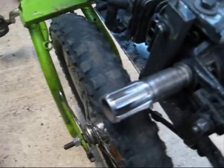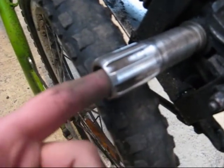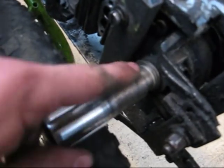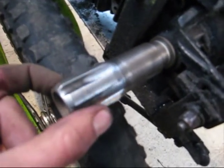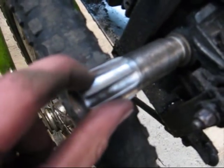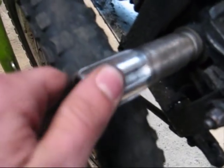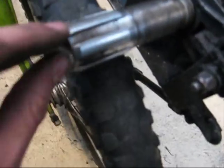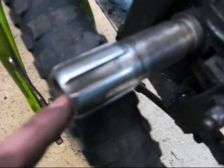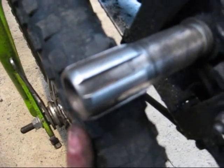Next thing is the spindle. This spindle is just a bit of — I think it's about one-inch pipe. I've bored it out with the lathe so I can get a spanner in there to tighten the nut that's right up here. And it had these grooves machined along it — I'm not quite sure what it was for, but it had them machined along it. Alternatively, you can use a bike spindle, a bike peg, but I'm not sure how good they are. Or you could even just get some smooth pipe and weld ridges along it, and that would probably also work as a spindle.